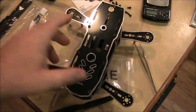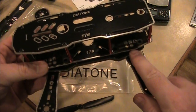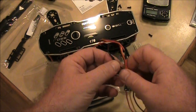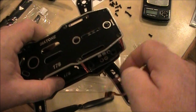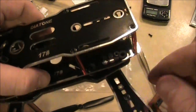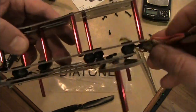Anyway, it looks cool. I think it's going to be really cool when you put the ESC wires on here — like this Afro 12 amp ESC could attach onto here. Then you take your two wires — I have extensions on here — and solder them right onto your positive and negative pads right in there. The nice thing is you don't have all this wiring going through there.